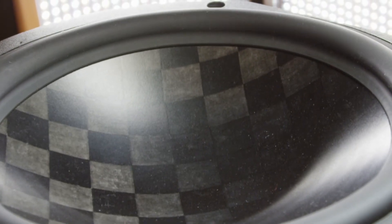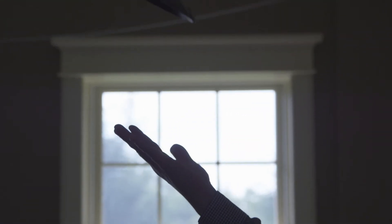The cones for our current series of mid-ranges and woofers use proprietary fabric that comes from Sweden, which has the lowest aerial weight of any carbon fiber fabric available. We then impregnate it with a toughened epoxy matrix.